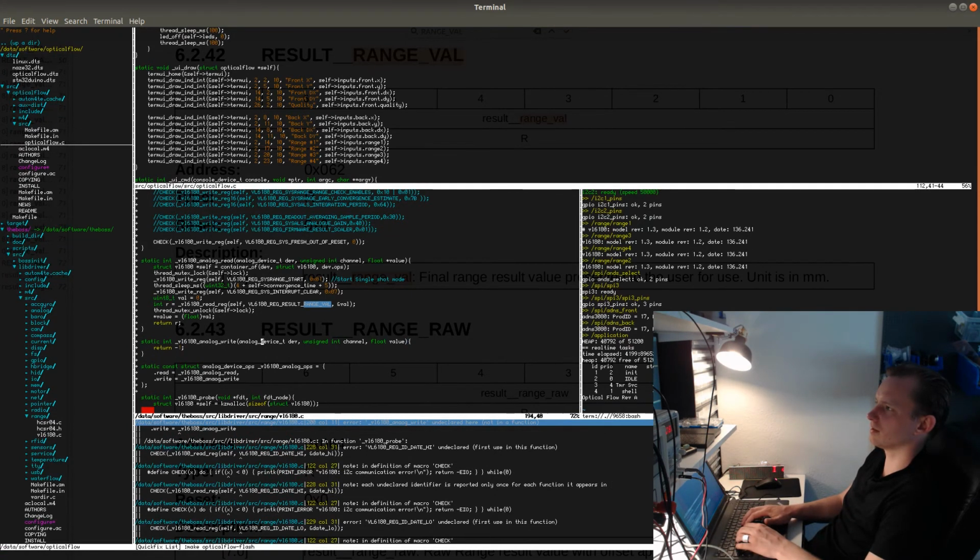And VL6180 analog write. Yeah. So uint32 and unsigned int are 2 different types, because even though they may be the same type in the system here, uint32 is still typedef'd separately. So as far as the compiler is concerned, they're 2 different types, which is good, because I get a warning there instead of just a blind conversion between whatever value this function accepts, like between the prototype of this function and the prototype of the pointer which I assign to point to this function. Very good that it outputs a warning for that.